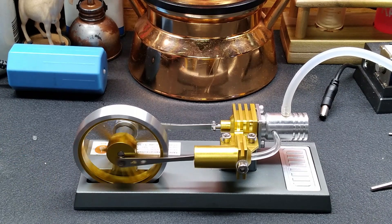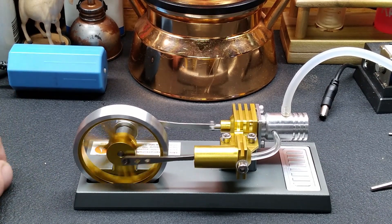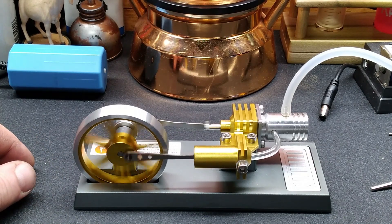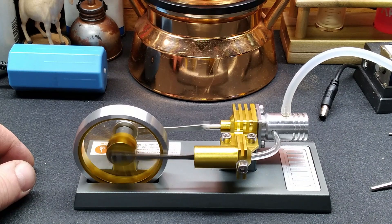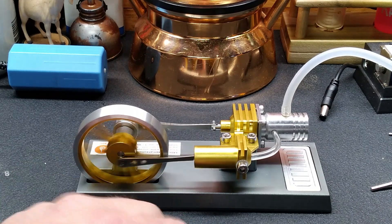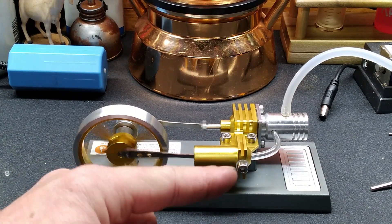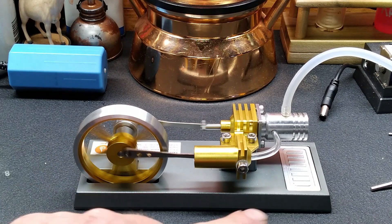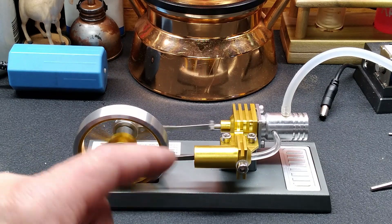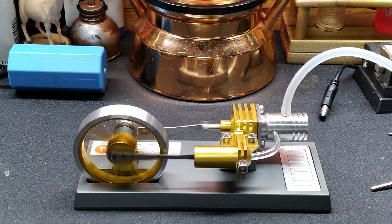Yeah, it's a nice running little engine. It's just this little guy here - I don't think it has quite enough power to get it to run right. Yeah, that's running on four pounds. Let me open it up a little bit. Pretty neat little engine, and mind you it is single-acting versus like a Stuart S50 or something where it pushes the piston back up. We're relying on the flywheel to carry it over and push it back out. I'll let this thing sit out here and run for a while - maybe it can lap itself in.